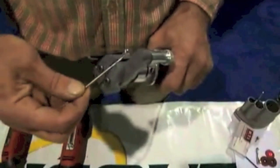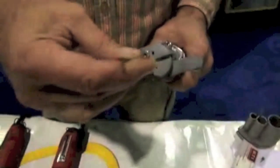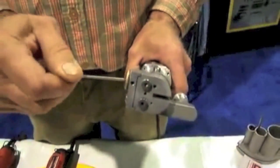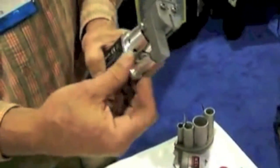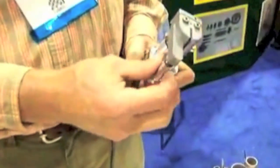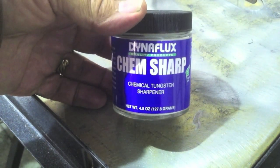There are a lot of benefits to having a dedicated tungsten grinder, like a handheld one like this. You can cut off a blob of metal easily with the diamond wheel. You can put a flat spot on the end, a consistent taper with the scratches all running like they ought to be, and the taper is consistent every single time — you eliminate variables. You can also trap the dust; this one's got a little capsule that traps the tungsten dust. But I don't have one. Every time I think about spending $300 or more, even up to $800, I wind up not getting one.